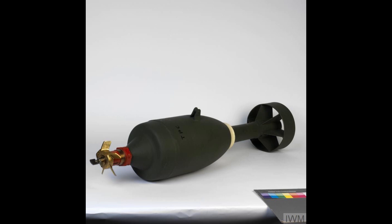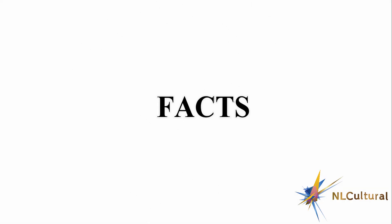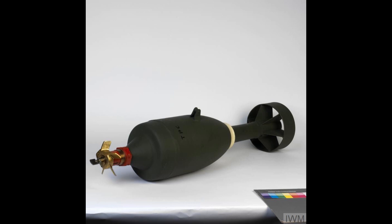Airdrop 35-pound anti-submarine hollow charge bomb, complete with nose fuse but minus the cylindrical nose attachment. In the summer of 1942, experiments were made using the hollow charge principle against tanks. Captain Terrell explains in his book 'Admiralty Brief' that the method of using the hollow charge was to place the explosive behind a cone of steel and fire it. The cone had to be a certain pitch from the base to the apex.